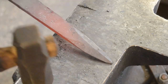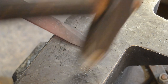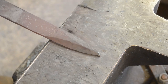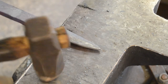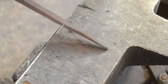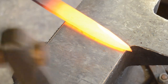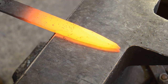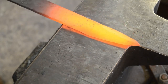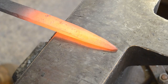Work at the edge and only at the edge. This is where the push technique, rather than the pinch technique of forging, really comes into its own — because you want to push those bevels back in rather than trying to draw them out in such narrow stock. You can see there the nice medial ridge between the two bevels. Then, like any other blade, we're going to start working our way down the blade section by section — normally four-inch sections at a time, overlapping into the last bevel — and we're only going to work one side at a time.